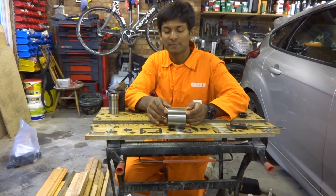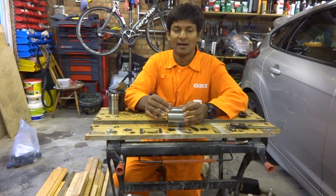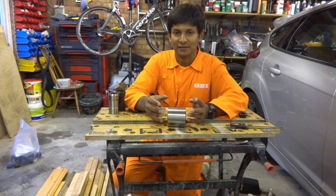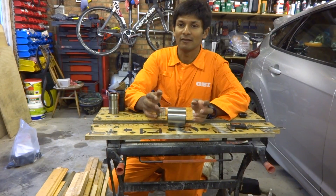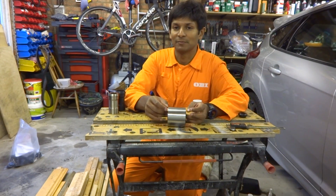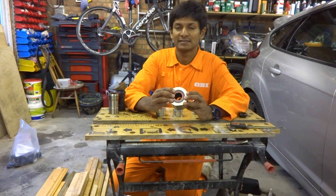However, from a purely performance perspective, having the bearings close together reduces the stiffness of the system and loads the bearings more. Now, if you're a mere mortal, whether you can actually feel that difference is questionable. With my modest 230-watt FTP, I don't think I'd notice. But if you're putting out 300–400 watts FTP, you'd probably feel the difference, certainly going uphill. The bigger bearings also make the system last longer.